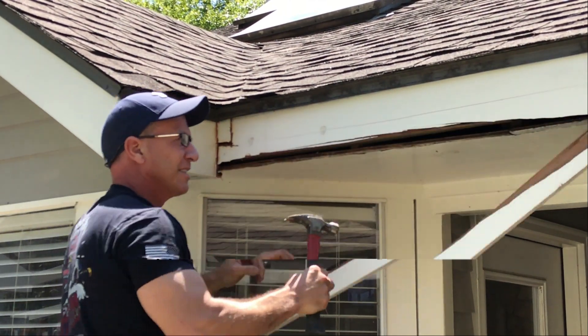I'm replacing this one, but I cut it on an angle — the same pitch as my roof — so I can set it on there and it's going to sit in the right spot, right on my sheathing. Right here I'm going to cut my sub fascia a little bit shorter; it'll be lower here, but when I come out here it'll still touch the roof.